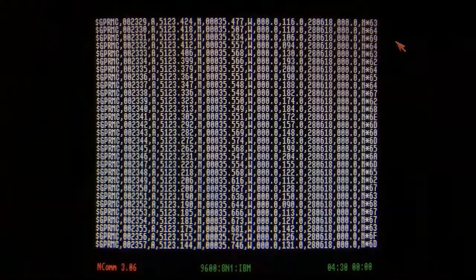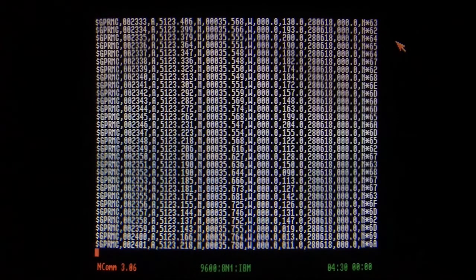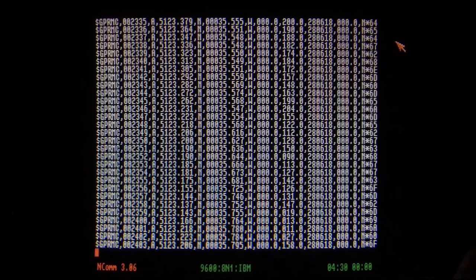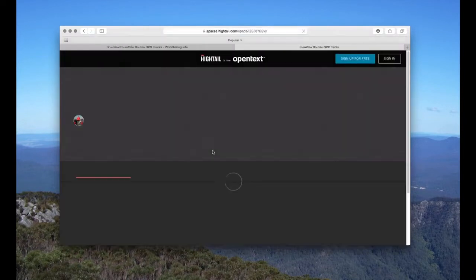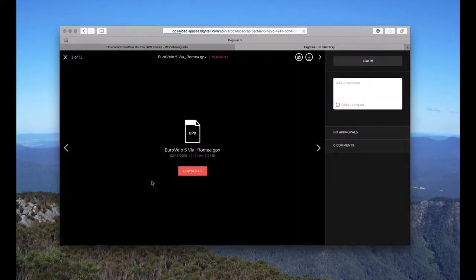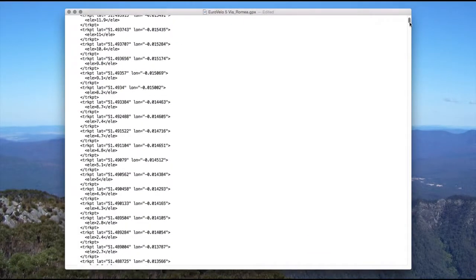Here I've implemented my first NMEA sentence, and that includes an auto-incremented time, the location, and of course the checksums have to be recalculated. While working on microcontroller software, I might as well stick to the same GPX file, and it might as well match the location of the map data for the product that I'm expecting. This is what it looks like in a text viewer.